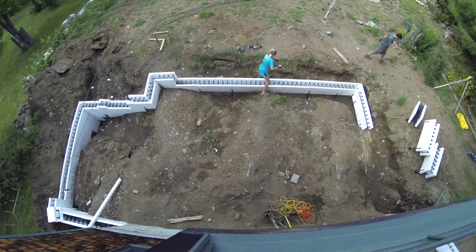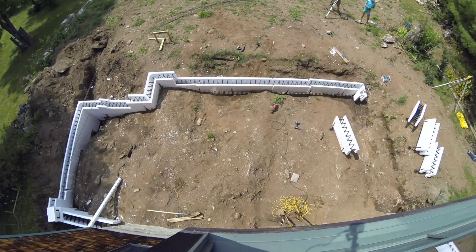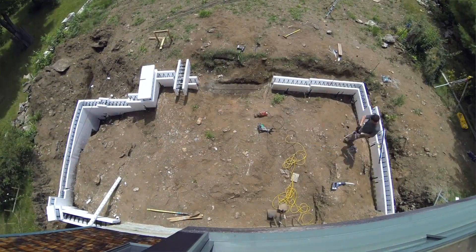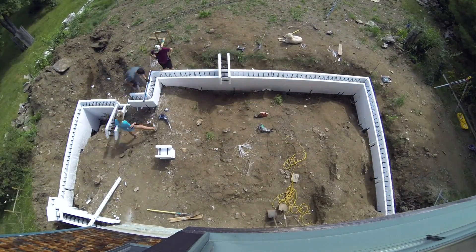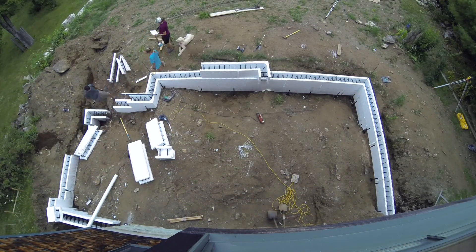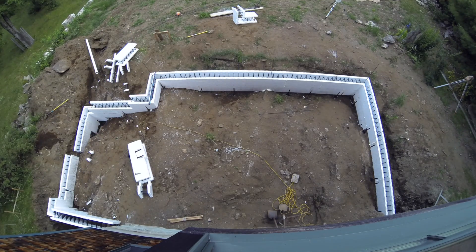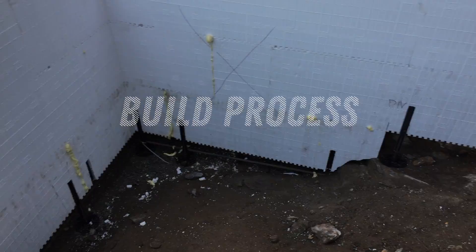The process today is going to be: take that wall apart, glue all the seams between the blocks with foam adhesive, get the feet in the right spot, and put the rebar in. I'll be drilling into the ledge and epoxying the rebar into the ledge and into the foundation. Then I'll work my way around, set the first course permanently, and build up from there. Building up from there is super easy — it's like putting together legos; the styrofoam fits easily together, you just bang it with your hand and move on.